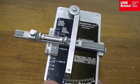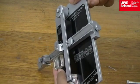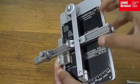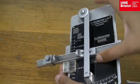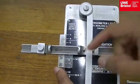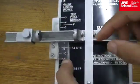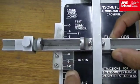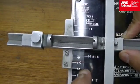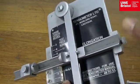To set the equipment, turn this dial here. Loosen it anti-clockwise so that it slides up and down the length of the gauge. Slide it into the position that has been measured in inches for this specimen — 0.992 of an inch — then tighten the screw clockwise so that it no longer slides up and down.